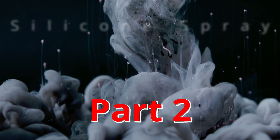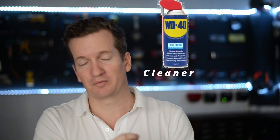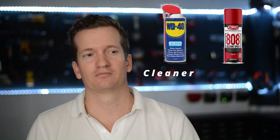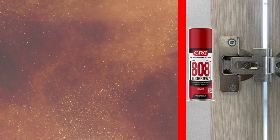How is silicone spray different to water displacement chemicals? As a solvent, WD-40 diffuses and dissolves many of the particles it gets exposed to. Silicone sprays basically just create a very thin layer of protective film over whatever you're spraying it on. WD-40 is a better cleaner of a mechanism, whereas a silicone spray is a better protector from future damage. The thin layers of silicone left behind will form a very thin film and actually protect the mechanism from future nasties, including air and water, which basically prevents rusting.